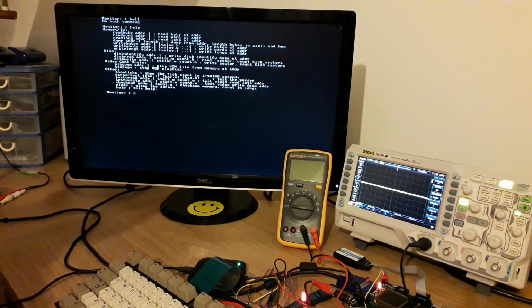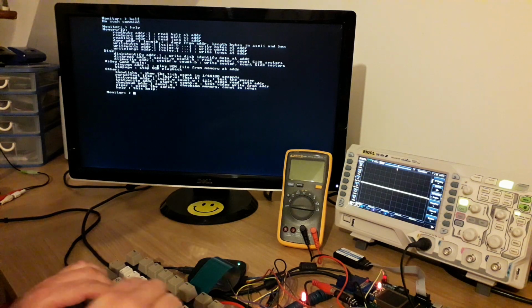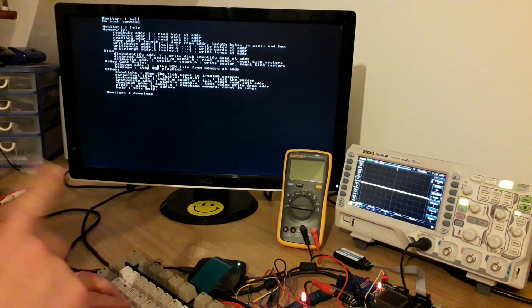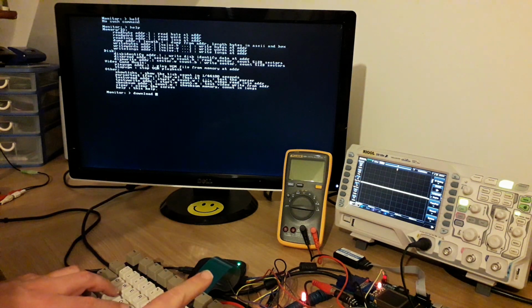What I've got here is this board has two serial connections back to my Linux server. One of those is for sending over ROM images. It's basically flash, inverted commas, new monitor code, and the other one is for sending arbitrary data, basically any binaries that I need to send between the two machines. So that server is running all the time on my Linux box.